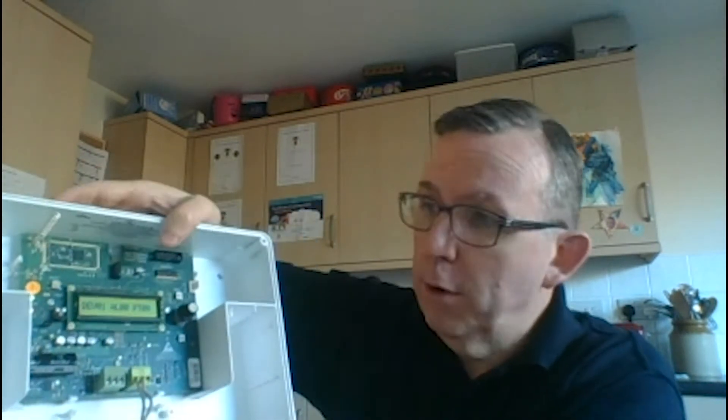These will create very high background noise which can affect the signals coming into this unit. The advice is to keep them two meters distance away from anything like that. Sometimes that's quite difficult to do, and I have actually seen these boxes fitted in electrical risers and working very well. So just a few things to bear in mind when siting your interface.